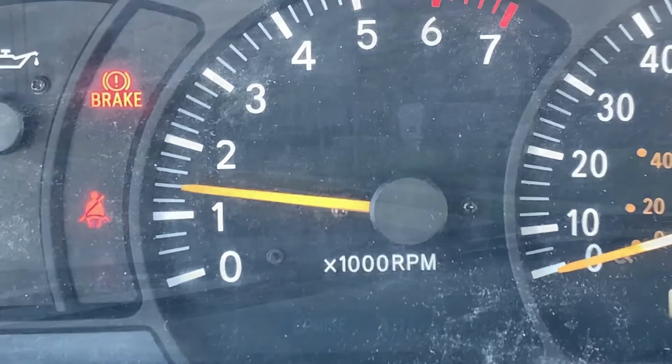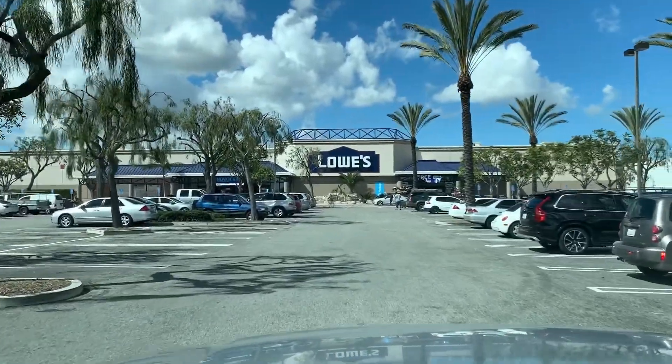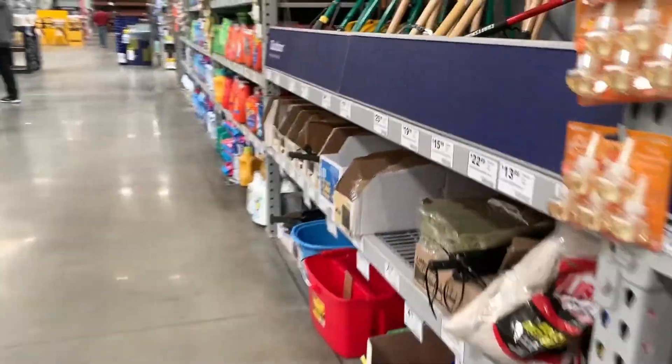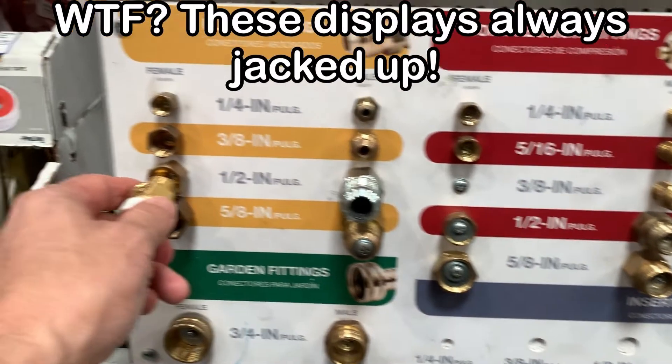In my silent compressor video, although I was able to replace one of my motors, the check valve was shot and I had to put a temporary solution together, which consisted of a PVC check valve and some threaded pipe fittings. What I wasn't able to install at the time was the unloader valve portion. Well, the new check valve arrived and now I can plumb the rest.